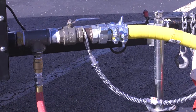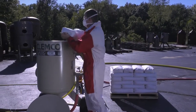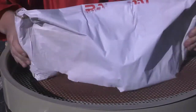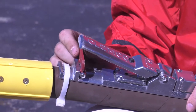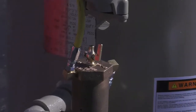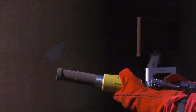Slowly open the compressor air valve to pressurize the air supply line. Listen for noise that indicates any open lines or leaks. Load your abrasive into the blast machine by pouring the abrasive into the concave head. Use the optional screen to prevent foreign objects that may jam the machine from entering the pressure vessel. Keep the abrasive level below the pop-up valve to prevent abrasive from being forced up and out of the machine when it pressurizes. Make sure the remote control handle lever is in the up, no blast position. When you are ready to start blasting, close the safety petcock. This allows the blast machine to be activated by the remote control handle. The system is now ready to begin blasting.